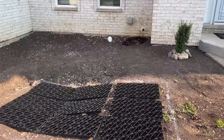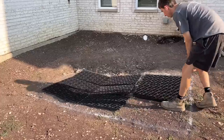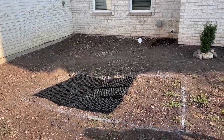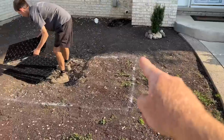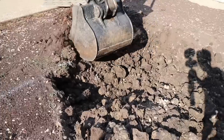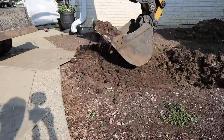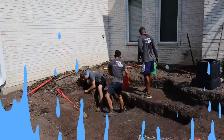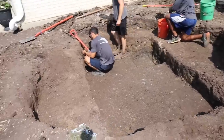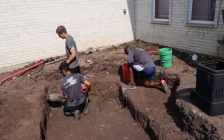A little trick - obviously marking out the reservoir isn't a trick - but you can tell there's no possible way three stacked urns are going to fit on that footprint. You'd want a footprint at least three times the size to catch all the splash. What we did is a smaller tank, but our liner will come all the way out to here, to here, to here, and back in there, allowing us room to set some pretty big rocks in here and more importantly, catch all the splash off of three urns. You can see the hole is dug, that depression just for the aqua blocks, the over-dig for all the accent boulders going around it, and the little depression for the vault right in there. Next is fabric lining.